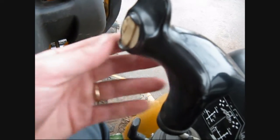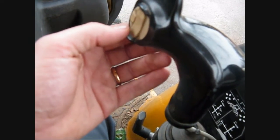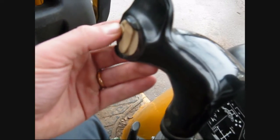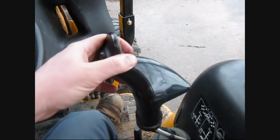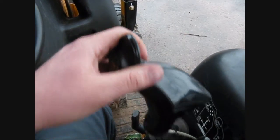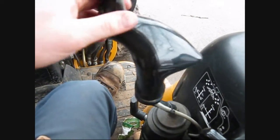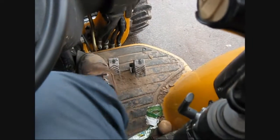There's your stick for the loader up and down. This would be for your bucket — open and close — or the chute for my snowblower, that's left and right. I'm not 100% sure what the other one on the front is for, but I've never used it. So to operate: if you want the loader to go up, you pull this back; to go down, push it down. Pushing this way and that way tilts your bucket. If you want to scrape, you tilt it down, dig the bucket in, drive ahead, scoop it back up, and lift. That's how this thing drives — let's fire it up and I'll show you the pedals in use.